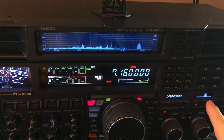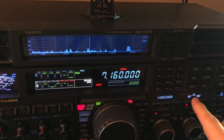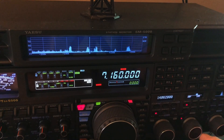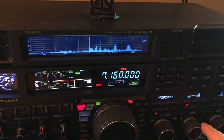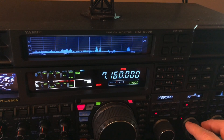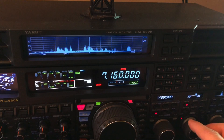The other thing you can use the pre-selector for — with the knob engaged — is you can rotate it up and down the band to decide where you want to center it. You're saying 'I want to hear what's in the middle and knock down what's on the edges.' Watch the scope and you'll see the center point moving. You'll hear some clicking — those are relays inside the radio enabling different LC networks, inductance and capacitance, which form a very high-Q filter. High-Q means very narrow: a small amount of signal bandwidth is passed.